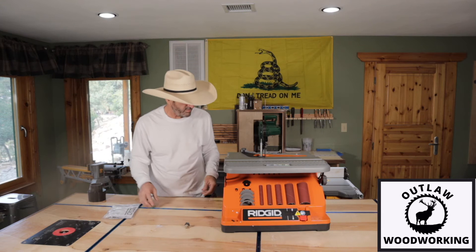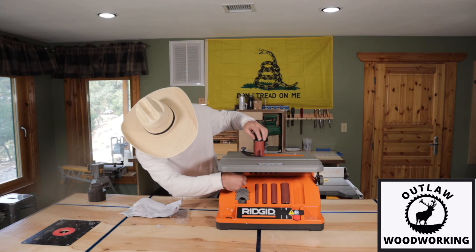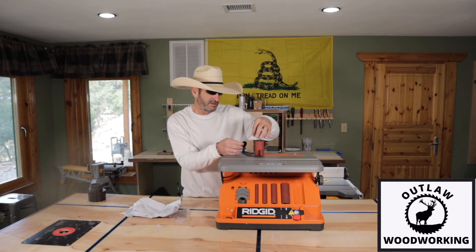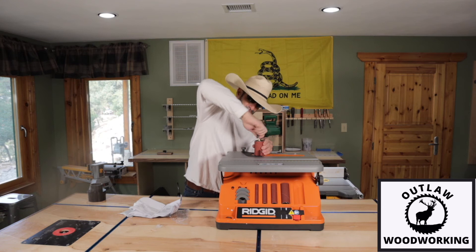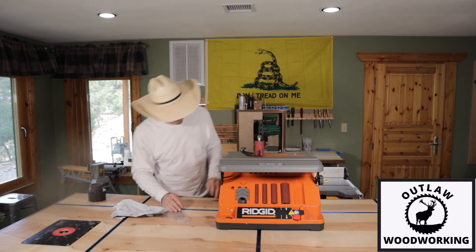Let's throw one of these spindles on — put the large disc on, we need to use this big washer. That squishes down the rubber that expands out onto your sandpaper. Pretty easy — so you have a washer for each of your spindles. The Allen keys are down here. Set your top to whatever height you want.